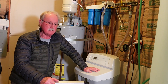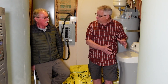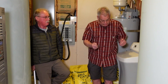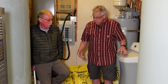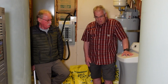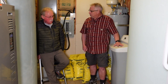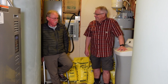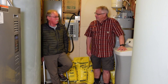It's basically standing idle now until somebody opens a tap somewhere else in the house. And that is basically it, folks. It's just there, doing its job when it's needed. Otherwise it just sits there idle. But as soon as there's a pressure drop, it turns on and repressurizes. Your house is just like it normally is. The only difference you'd notice is that your flow rate is less than when city water is on — but you want that, because you want your flow rate to be less so you can conserve your storage water. So for you and your wife, about how long would this last? Depending on usage — if I could get her just to wet, soap, and rinse, we could probably push it to 10 to 12 days, maybe even two weeks if we really went conservative.